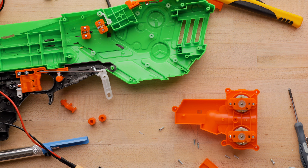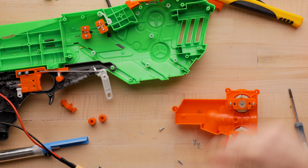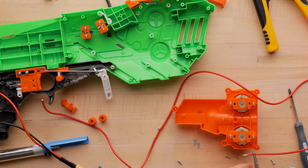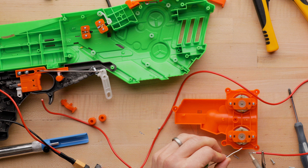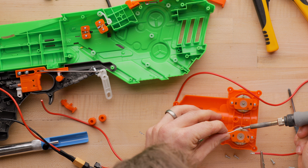Normally I would use a fine tip Sharpie. From there we're just going to get soldering. Lesson learned — I'm now going to use a nice shiny new tip instead of this old oxidized one, and I'm going to tin my connections. I always like to tin connections like these before you attach, because the fresh solder gives a very good conductive point for very easy soldering, and it will help you get a better joint as well.